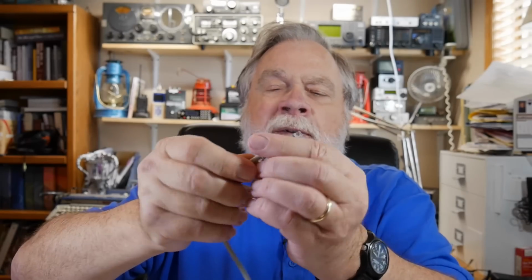So I thought what we'd do, just for fun, since there are a lot of radios out there that do not have sound cards in them, a lot of radios out there. This can be set up to work with any radio. By any radio, I mean any radio. You can get a cable for about $15, or you can make your own if you're good at making these kinds of cables, and just wire the correct part to the microphone, the other part to the speaker, and the other part to push to talk.